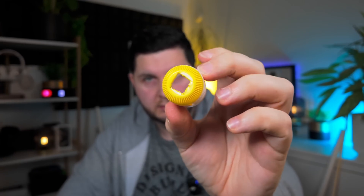In one of the bottle cap ends, you want to make a square hole — I literally made this just with a knife. Be careful though, because the plastic at the top is not very hard, so it was very easy to make that hole. You only need to make the hole on one bottle cap; on the other bottle cap it can remain complete. For the sake of this video I'm just going to use tape, whereas on the other LED tube I did use a glue gun to go all the way around. So I'm going to put the lid on top and just with tape, go around and secure it. One bottle cap done — second end done as well with the hole in the bottom.